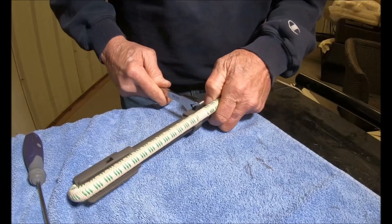After installing the bungee on the other gear, you'll need to do a gear extension test, making sure that both the gear and the indicator system are working properly. Also, make certain that the landing gear is down and locked before removing the wing jacks and untying the tail.